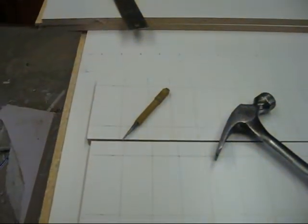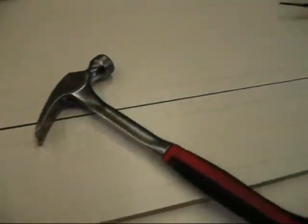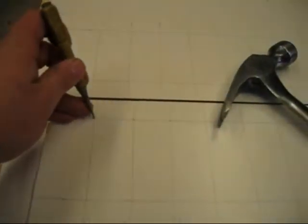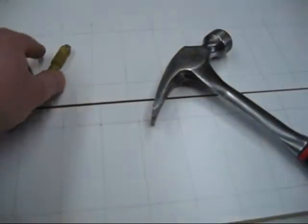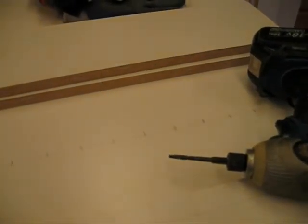Now I've got all the sides cut to length and everything. I've got to drill some holes for the shelf clips, just like that one. I've got all my lines lined up there as you see, and those ones on the back. Right now I'm just punching a little hole at each intersection so the drill bit can find where to go. Then I just got to put some tape on that drill bit so I don't go too deep and we'll have it made.